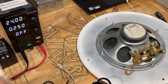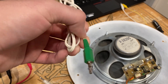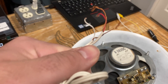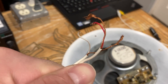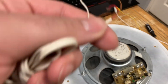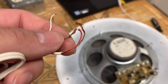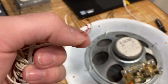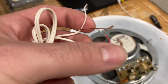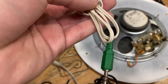What you will need is some sort of auxiliary audio connector like this, and a 3.5mm cable. What you want to do is chop the other end off and expose the wires. This particular one has two exposed copper wires — you want to take the two bare wires and twist them together. Then the red and the white, you also want to twist them together as a separate pair. That's with this cable.